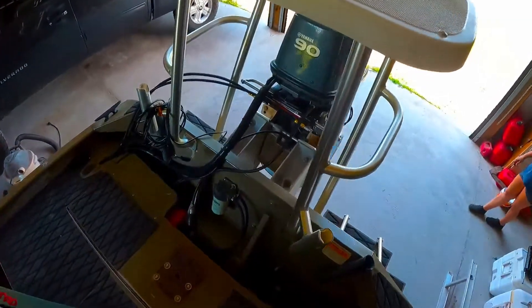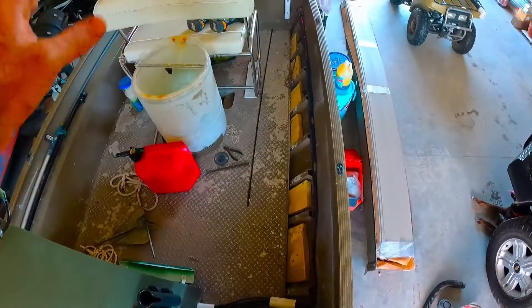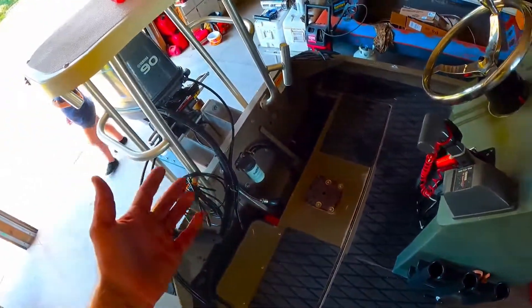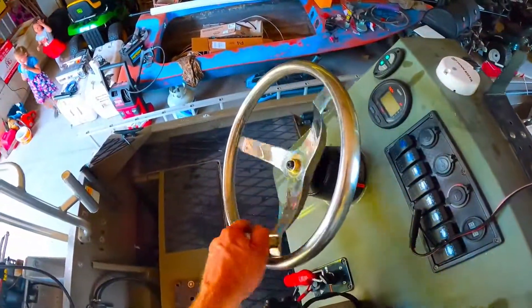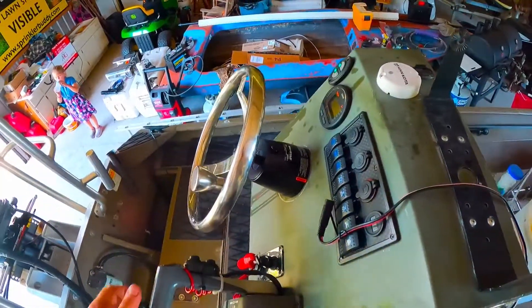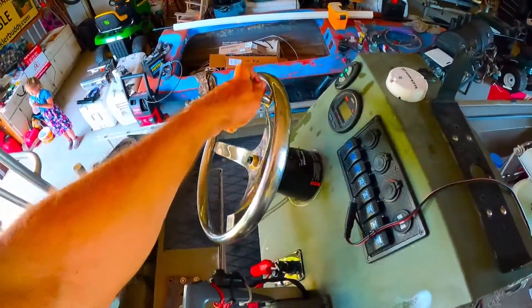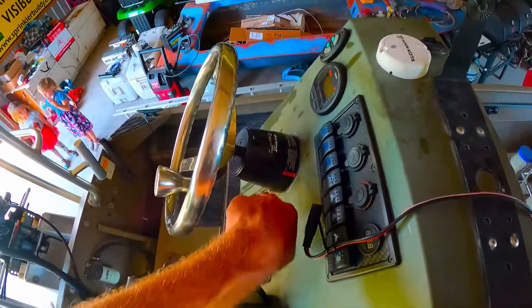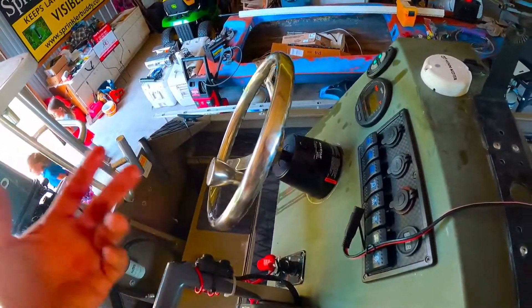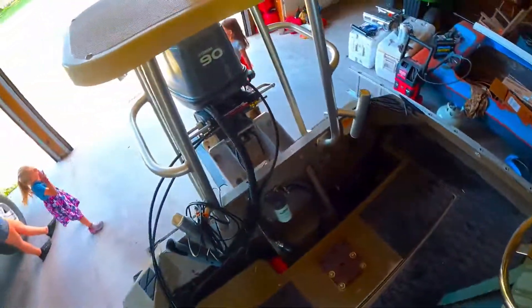Other than that, pretty good. We're going to clean the boat off, get all the fluid off, and then we're going to probably do some more stuff before we put the cover plates back on. I want to do some more to the boat and then we'll get out and test it and see how it does. It seems like we got all the air out on the second go around after we were able to go back and forth with it a couple of times. Really easy to turn now - our first mate junior will probably be able to start driving the boat now. Not bad, Baystar - expensive compared to some of the knockoff stuff, but comes with the fluid, bleeding lines, and other stuff. It's a name brand product that's been around, so we're going to see how it works out.